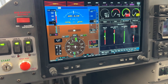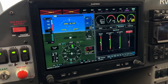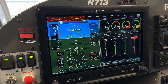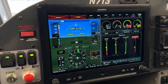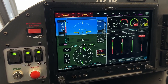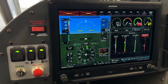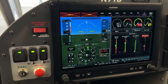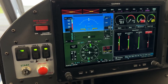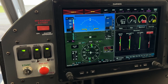I would definitely recommend performing Service Bulletin 58 and replacing the HIC module. In one of my older videos you'll see me talk about being stuck on an island because of some janky connections to that module. So that's been about a minute — I'm going to call this one a success. You can see how the voltage drops pretty quickly, 13.6 down to 13.4 just from running for a minute or so, but I'm going to call this one solved.